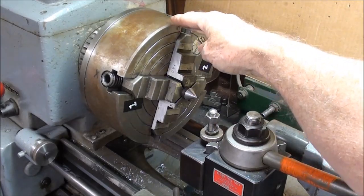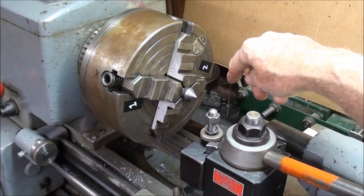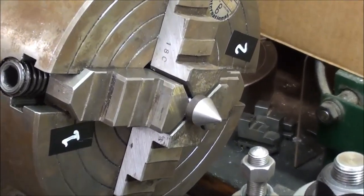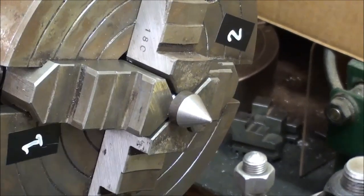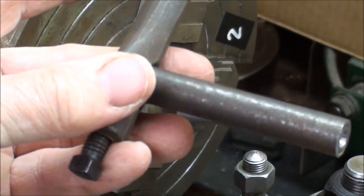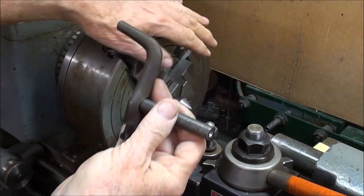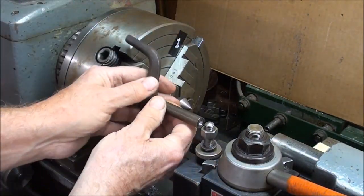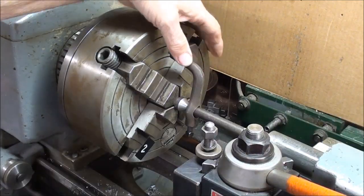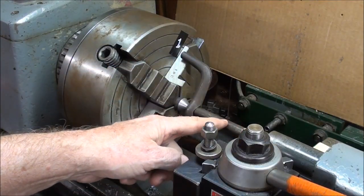Here's how I'm going to set this up for a two-start or four-start thread — in this case a two. I've numbered the jaws one and two, and installed that center up to the shoulder, then took a very light cut on it so it's true — truly 60 degrees. Now I have mounted my work between centers with a lathe dog on it. I'm using the four-jaw chuck as if it was an accurate drive plate or dog plate. Bringing the work up between centers against number one, I would go ahead and cut that first thread as shown earlier.